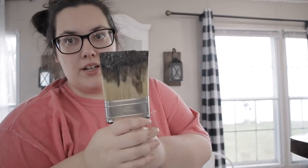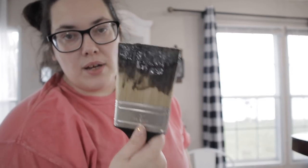You see that right there? That's what gives you the wood look. But you have to go really heavy handed on your poly brush. And see, some of the glaze will come off on your poly brush. It mixes with the poly, that's okay. As long as there's poly in there, it's going to glass right over. I am going to have to do about 6 coats of poly on this to make sure it's durable enough to be a kitchen counter.